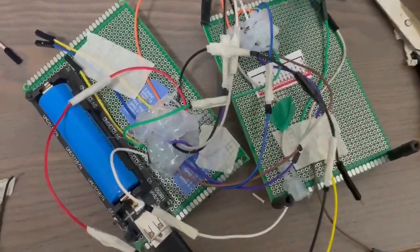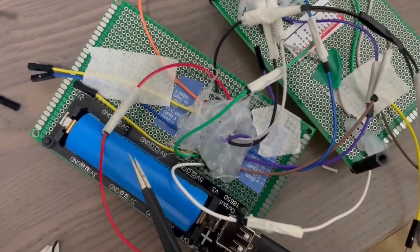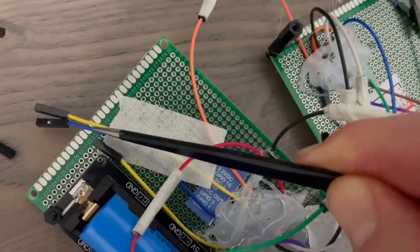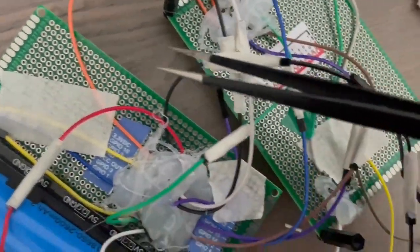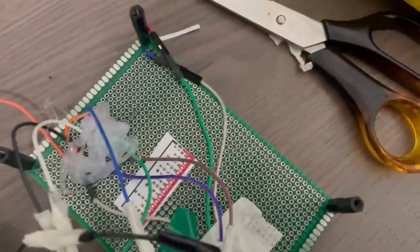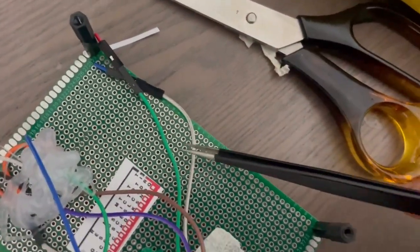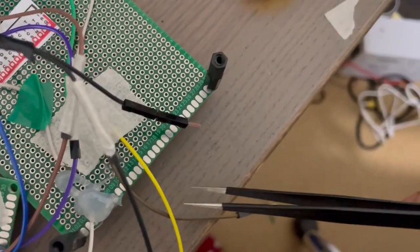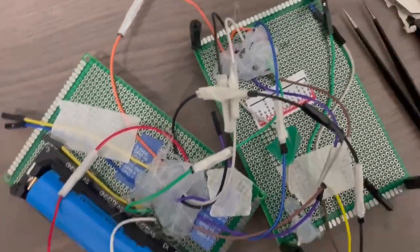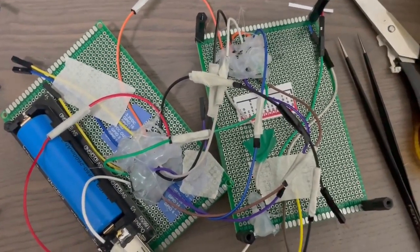I've finished the wiring now and this is what it looks like on the back - what it's going to look like on the inside of the camera. I've got the 18650 on this WeMOS 18650 board, and I've broken out the RX, TX, and zero pins for easy access if I need to reprogram the ESP32 cam. These wires here are for the SD card, but I'm not sure how to connect it given the limited pins available - I'll see if I can do that later.